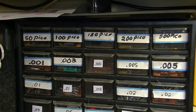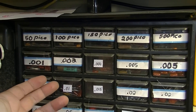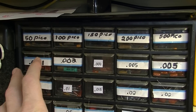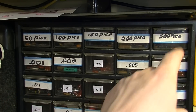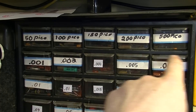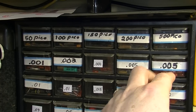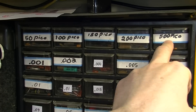You can spend a lot of money on capacitors or you can spend very little, and some of the cheap ones aren't all that good. But these are fairly generic and they seem to do the job just fine. This is what I would propose stocking if you're just going to stock a few capacitors for everyday use. I would even skip the 100 if you're just starting out — get a 500, because those are used in bright caps a lot. So get a handful of 500 picos.